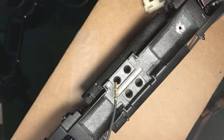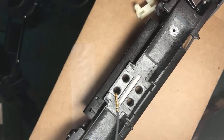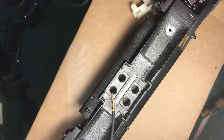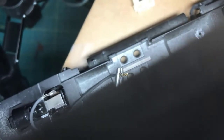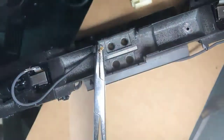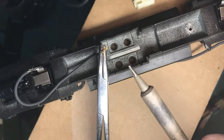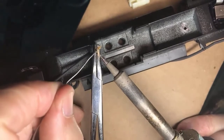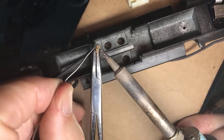And again, we have that problem of, will you please hold still, you blankety blank piece of wire or connector or whatever it is. I'm going to use a hemostat to hold the work still. Okay, get the hemostat here and get this out of the way. And now here is where delicacy and fine solder is a necessity, is I want to solder the wire where it's crimped in this little part here, but the connector spring is right here.